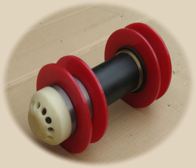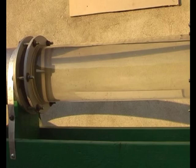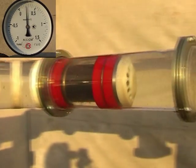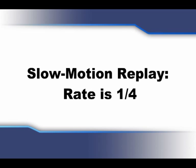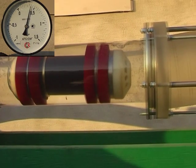Let's see what the advantages of the pig with active cuffs are. Inserting the pig into the launching chamber and starting the pump. It can be seen that the pig body oscillates and the cuffs are moving with respect to each other. Now let's see a slow motion replay, making the pump rotation a bit faster. The pig is approaching the globe valve and it can be seen that the cuffs are moving.